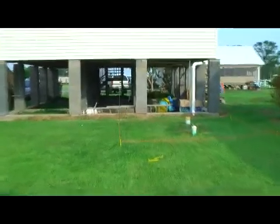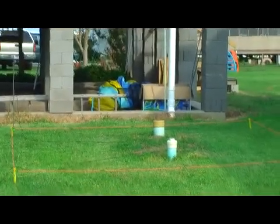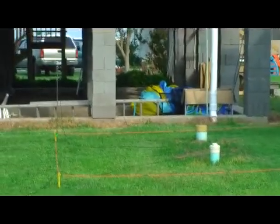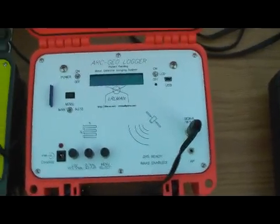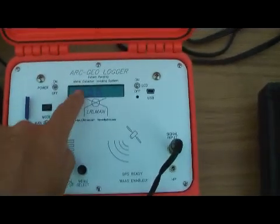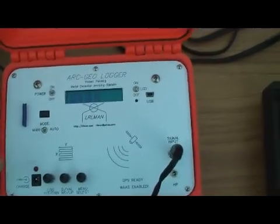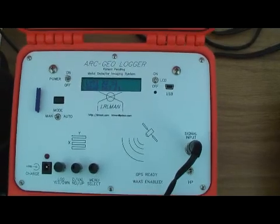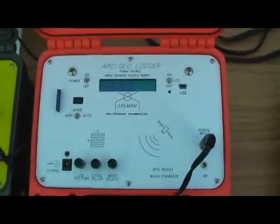For sake of time, I have my probe at the first position — that's four yards across. I'm going to move every 18 inches and go ahead and do that whole first row. When I get to the end of the first row, I'm going to move over down 18 inches and come back. I went down the first row, moved over 18 inches, came down the next row. I'm on X2 — on the last one you'll hear two beeps at the end of this row when I take this sample. There are two beeps showing that I'm on X3. Now I need to move over 18 inches and go back the other way again.